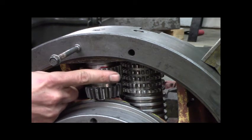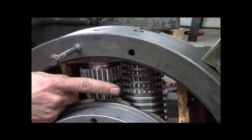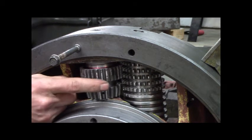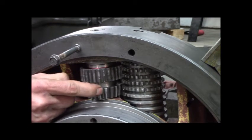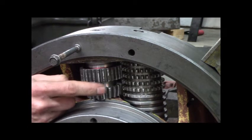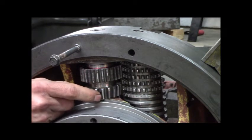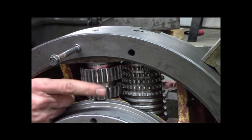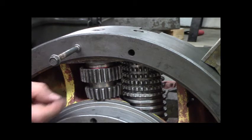The spur gear communicates with another spur gear - and you'd say, well that's not a spur gear - well it is, it's got spur gear teeth cut in an Acme thread. I guess you'd call it a worm. The gear teeth are interrupted with the helical spiral, because it's essentially a big Acme screw thread with gear teeth cut in the threads. That's kind of unusual, and it's reduced surface bearing area, but I can't see that it's worn any - either gear, the spur gear or the teeth cut in the Acme worm gear.